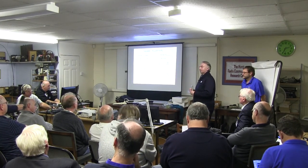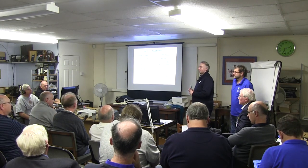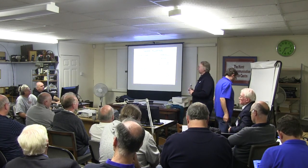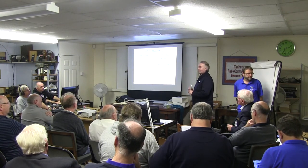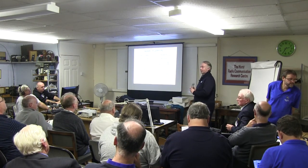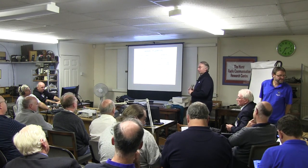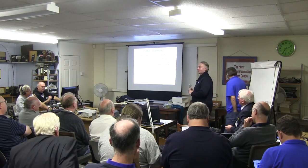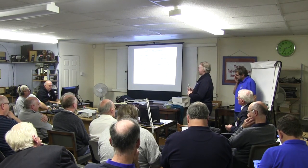Okay, thanks. The first version of Minitune didn't decode the audio and video, so you have to send it out somewhere. You send it out as a UDP stream, a network type stream, and it's there then for anything to pick up and decode, and VLC can decode all sorts of different things from all sorts of different sources. But now with the latest version of Minitune, we don't need that anymore. It's all done internally within the software, so it's goodbye VLC.